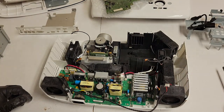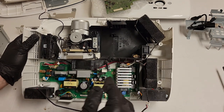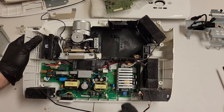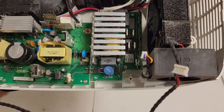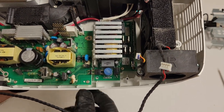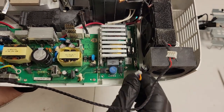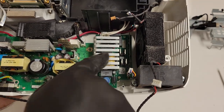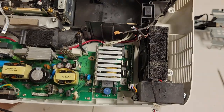I'll just set that over here. Now, unlike the 1070, HD1075, etc., that's the ballast. This tiny little fella right here. It gets its 380 through this connector right there. That's roughly 380 volts when it's on. Then the control comes in through that wire, just like on a standard size ballast. There's the MOSFETs, there's the heat sink, and there's the lamp wire output.